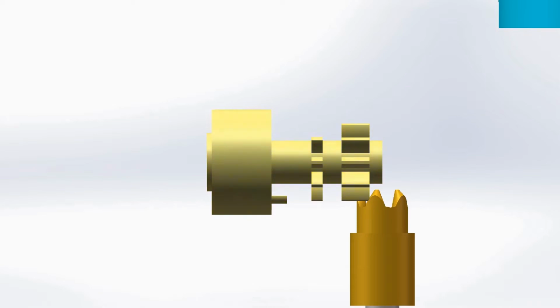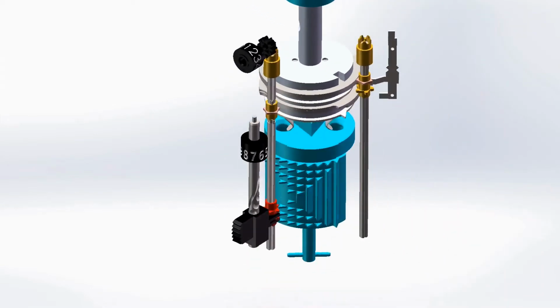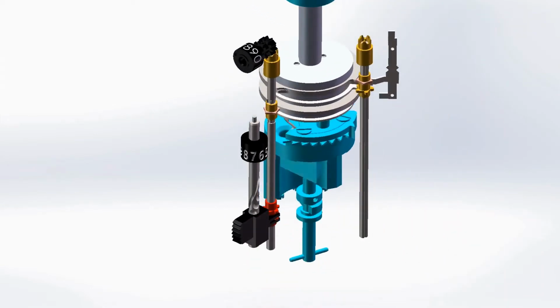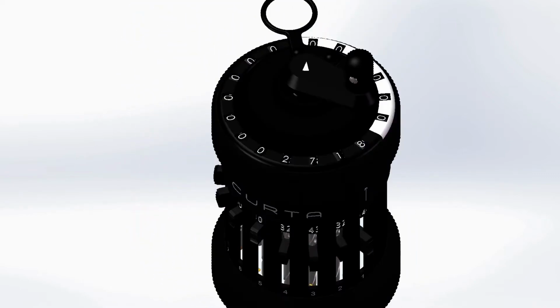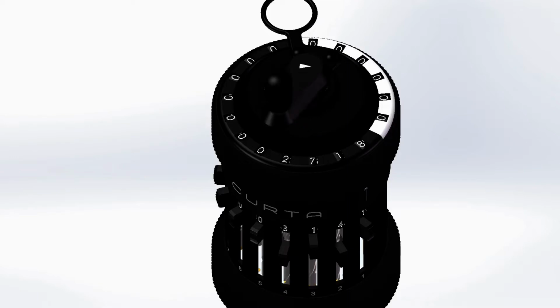At the top of the shaft is a transmission gear, which meshes with the teeth on a numeral dial. This turns the numeral dial as many increments as the count gear, thus incrementing the dial as many times as specified by the setting slider. The setting sliders are then set to select the second input, which is added to the current figure.